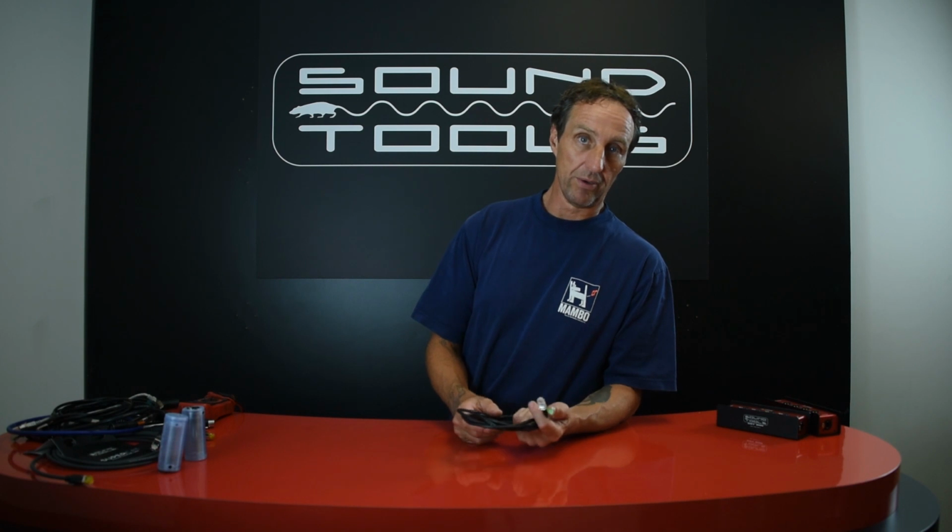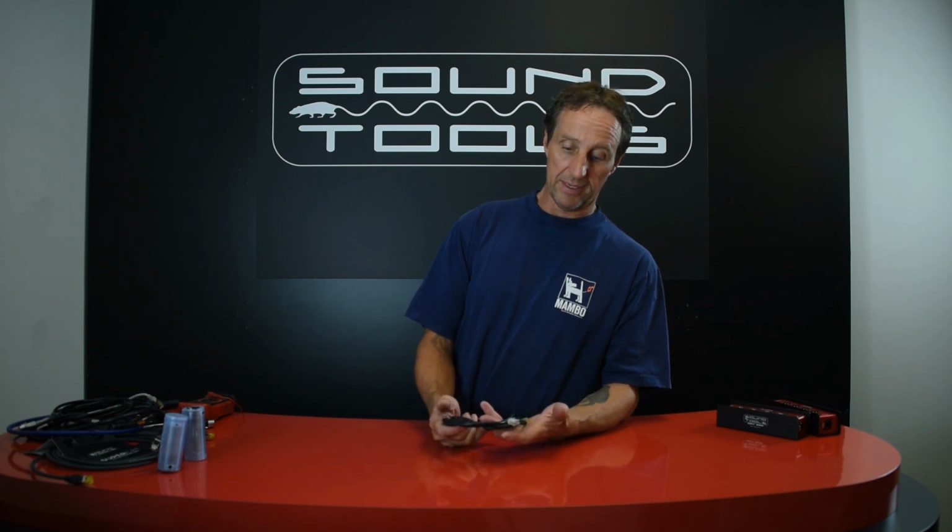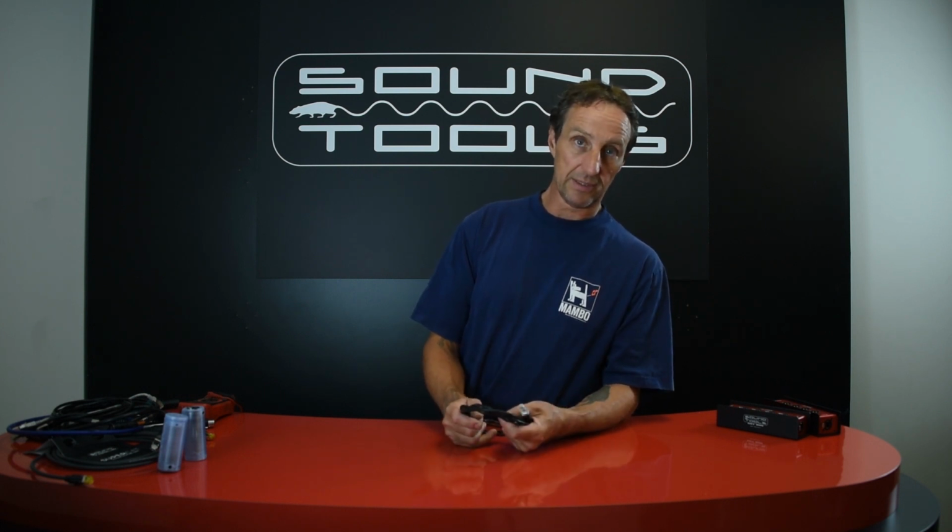That 9th wire, or the shield, helps eliminate hum and buzz, but it also carries the ground part of phantom power and allows us to utilize these data cables as high quality audio cables with a shield or a common ground. So how to tell if a cable is shielded?